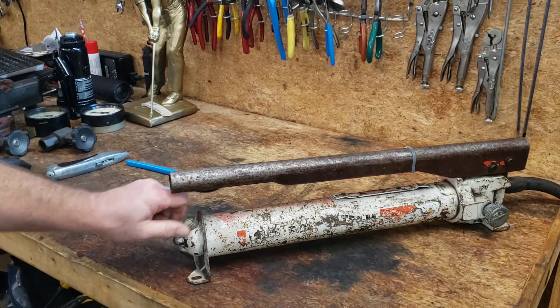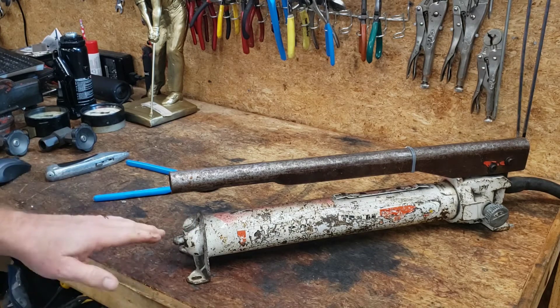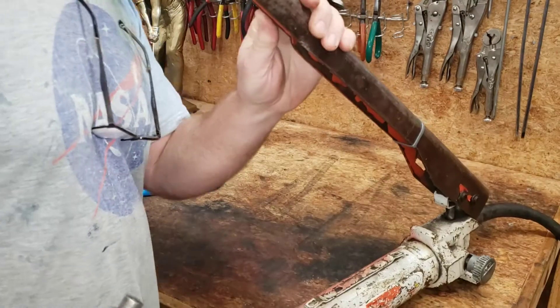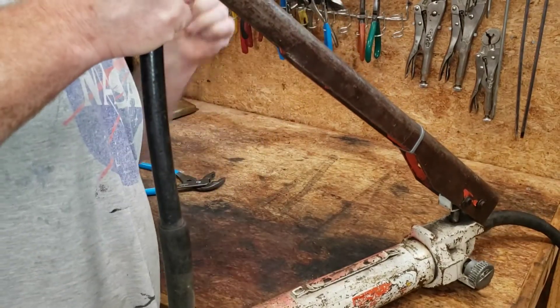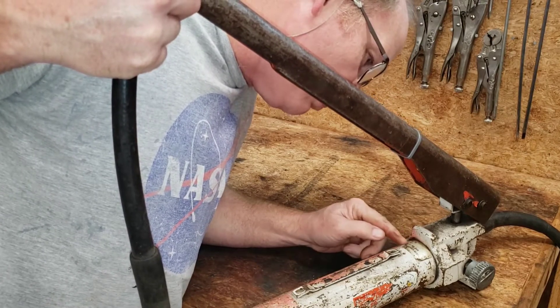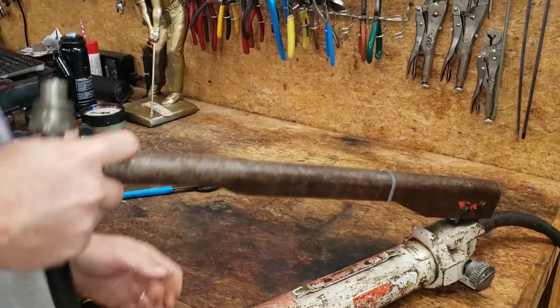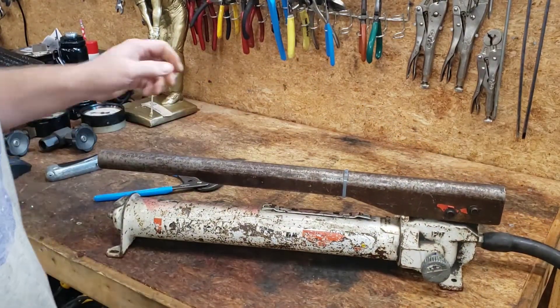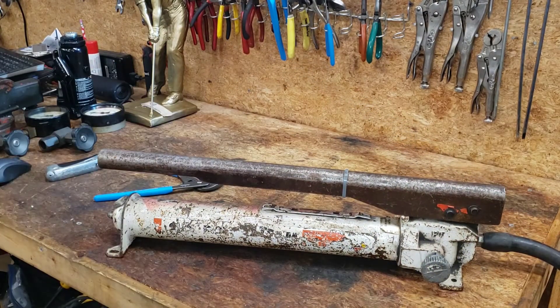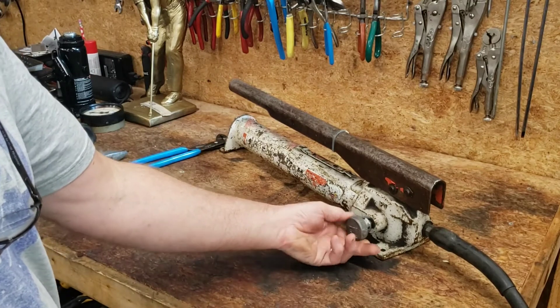It's got some debris right there — I'm going to blow that off before I take it off and check for hydraulic fluid. Let's see what the label says: part number P55, Model B, goes up to 700 bar. That will supply much more than enough hydraulic pressure to test a diesel fuel injector. This is the release valve on the side.